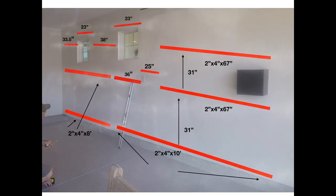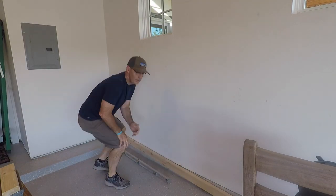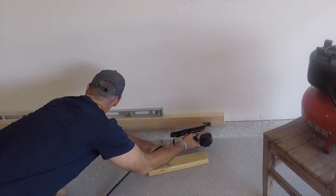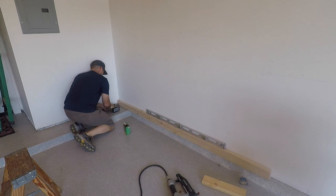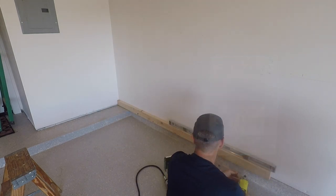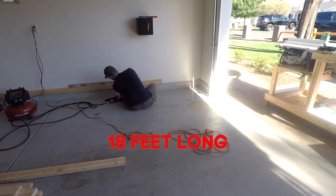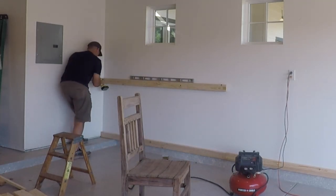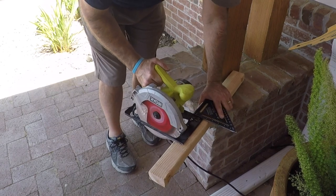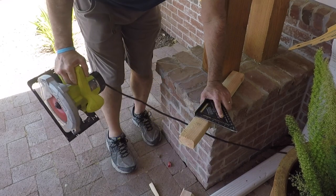Now it's time to permanently attach the first set of lumber to the wall — the horizontal shelves. I can put the full pieces of wood I know I have straight onto the wall. I'm using a pneumatic nailer — fancy equipment you don't necessarily need. I use two-inch 18-gauge nails to put it up, then screw them in with three-inch screws. This is a two-by-four by eight, and the next piece is a two-by-four by ten, making an 18-foot long shelf. If all you have is a circular saw, no problem — I recommend using a square to guide your saw for more accurate cuts.